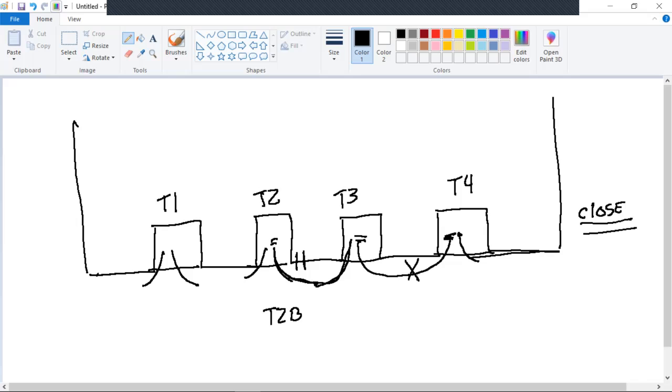But here's the severe problem going into the situation. Once I get this put back to normal and somebody comes down here, either T3 or T4 in the situation that's going on, and plans on de-energizing the cable, not the transformer, they are going to pull off an elbow and it's going to de-energize both T3 and T4 when they only wanted to do T4, and vice versa. If I'm going back this other direction, it's an easily solvable problem.